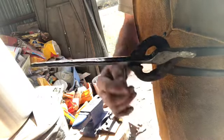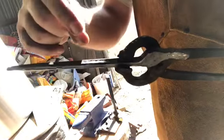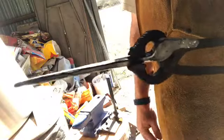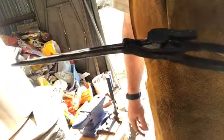So if you thought of it as in cross sections, then when you get up here, all 8 sides should be equal in width, and otherwise you're going to kind of end up with more of a boxy octagon, I don't know, an uneven round. It's going to be hard for you to get it exactly round if you don't pay attention to that as you go.